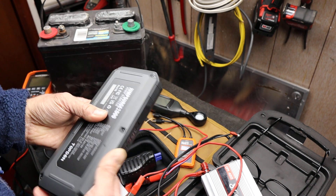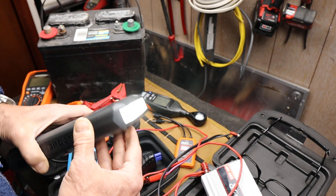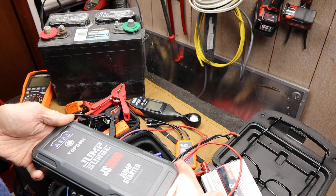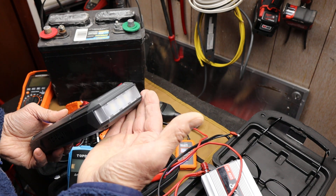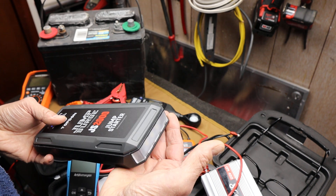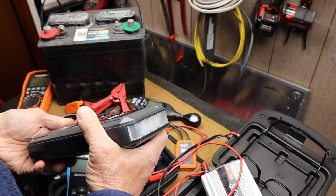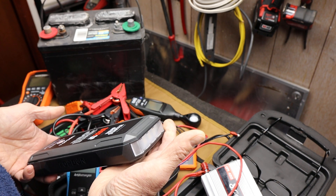That's when I need this. On top of all of that, if you think about using any of the other features — this one does have a light, it's not going to draw a lot, but it says it's 300 lumens. I tried measuring it with my Klein light meter and figured it's about right — looking at foot candles, I got about four. You can also run an SOS and a strobe. I could see if you were limping home, maybe put this in the back window as a signaling device while you're driving. If you're way out in the middle of nowhere, something like this is easy to see. Search and rescue will use infrared detection equipment and they will pick this up from a huge distance away in the night.